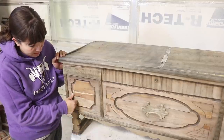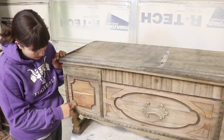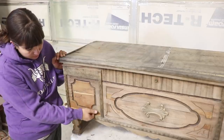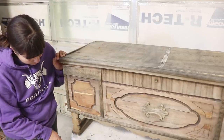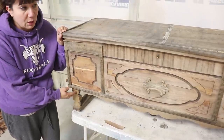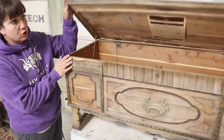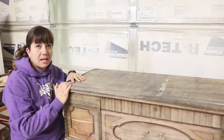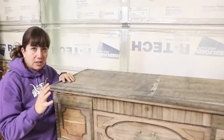It's got lots of chippy veneers. Most of it is just coming right off because this lived outside for a while. So we're going to remove all of the veneer that's loose and sand it down smooth. Zeb's going to replace this foot and the front piece here — we have all the parts. Then we're going to strap down with metal straps underneath to pull this warped top down and make it a little bit more structurally sound.